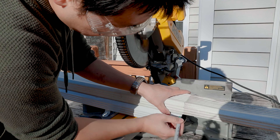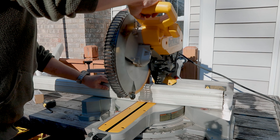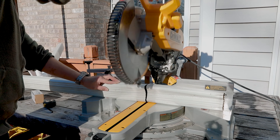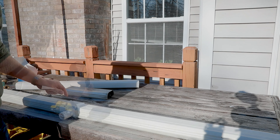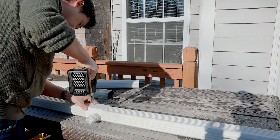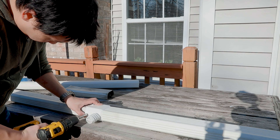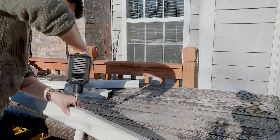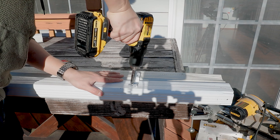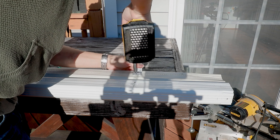Here I'm basically cutting the bottom half of the downspout, which will make an easy swap of the old one for the new one. When everything is cut at a proper length, it's time to secure them with metal fastening screws. And if necessary, transfer any supporting mounting brackets to your new downspout.